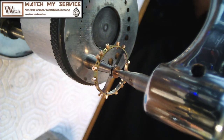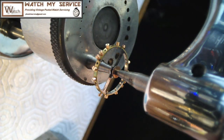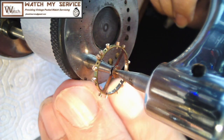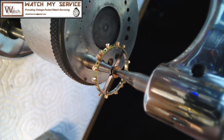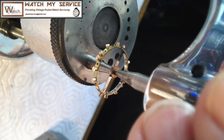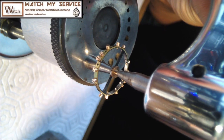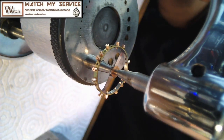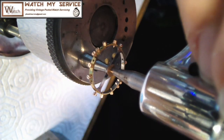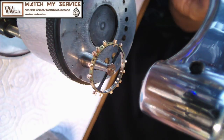I've got the staking set all ready to pound down. I'll simulate the staking - there's my hammer. Now I'm going to simulate the pounding of the roller table down. Look at that - it went down really nicely, which means the degree of taper on that balance staff was absolutely perfect. It's supposed to be like a 3 degrees of taper on the balance staff to be impeccable. So that job is done and dusted - that's 90 degrees.